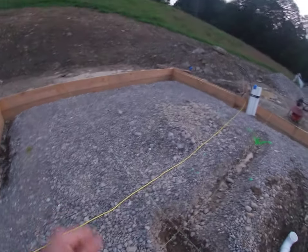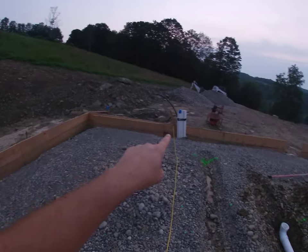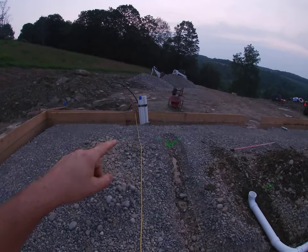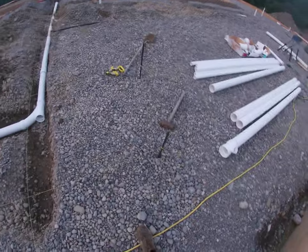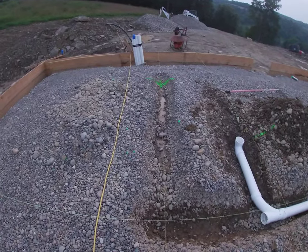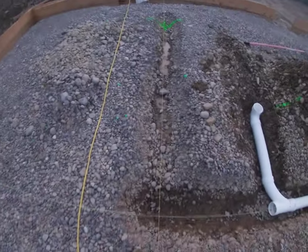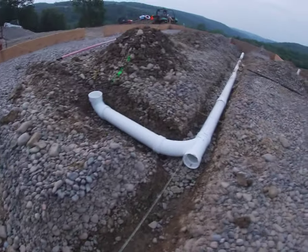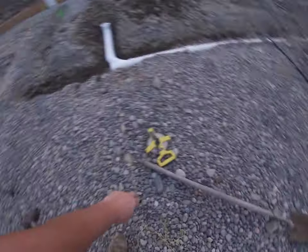Where it's in a wall cavity, you have to be right on the money, otherwise your walls are going to be shifting and it's going to cause a lot of problems. So I measured off the form — that's on my slab utility plan like I showed on the foundation video. I measured out, pulled a string line, made sure it was square, and that's what we dig to. I keep these right in place. Using paint is a problem because once you dig the top layer of stone off, you've lost your mark. I like these string lines — they work pretty good; you just have to be careful where you're stepping.